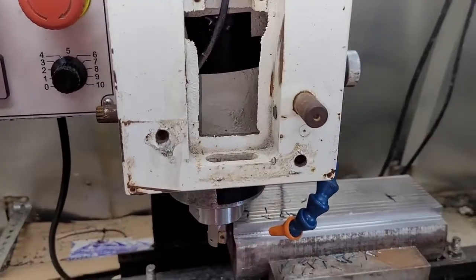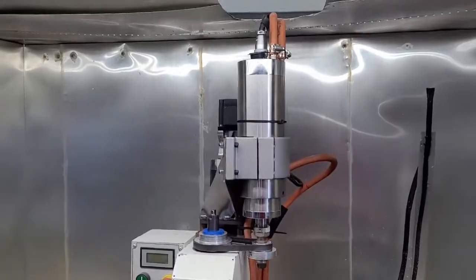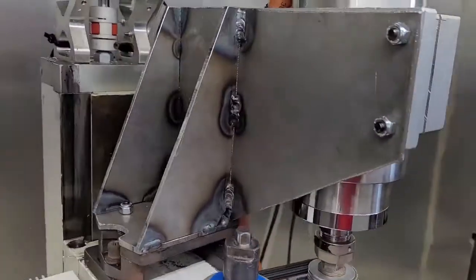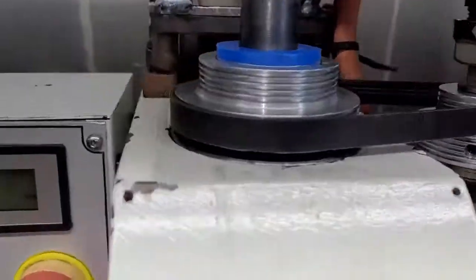The next step: we've got to take all this apart and play with the bearing preload until we get that happy. Yeah, it looks like the motor upgrade itself is doing what we hoped. Looking better. Our brace fixed the flexing — it's not flexing enough to matter anymore. Our belts stayed tight. We didn't notice any belt slippage. I don't see any rubber up here. Belt looks to be fine.